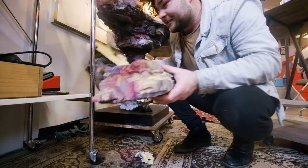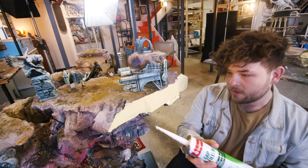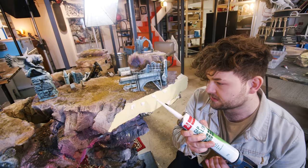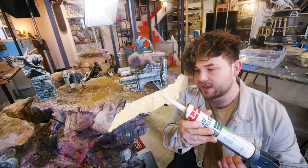Even though this is a pain in my heart, we have to be careful with our placement of the gap filler. What we're trying to do is get enough adhesion, but also allow airflow to go through the gaps and actually dry the gap filler. Because if you create a perfect seal, the air will never get to the middle of this and the gap filler will probably never dry. But if we're careful, this should work quite well.